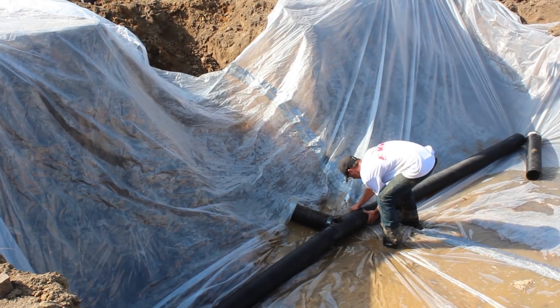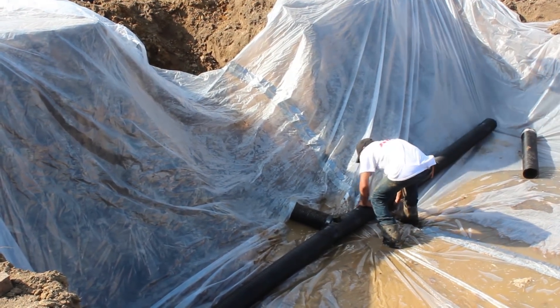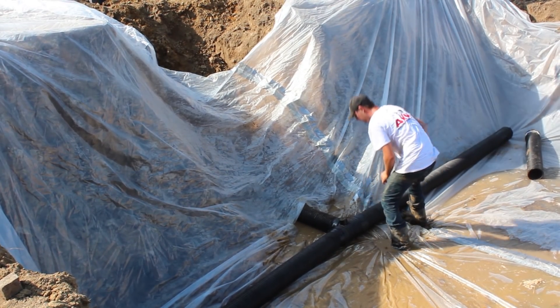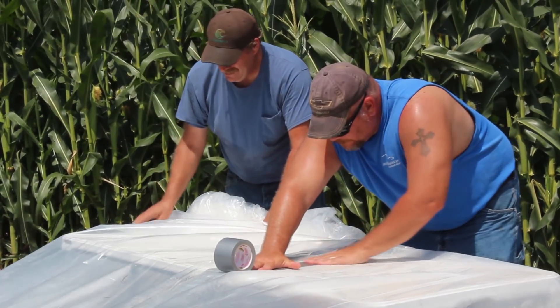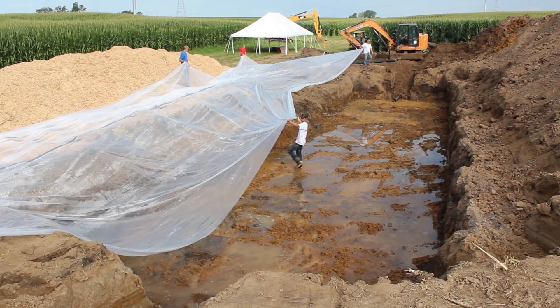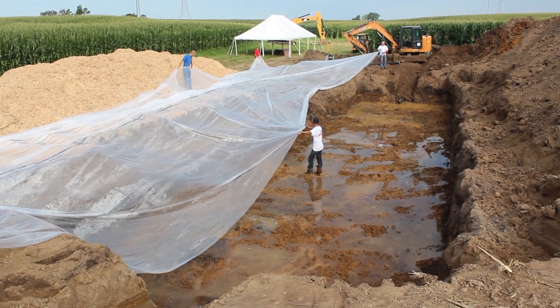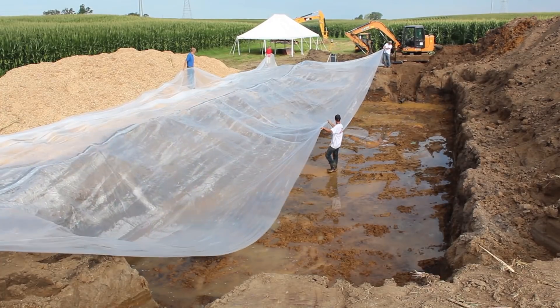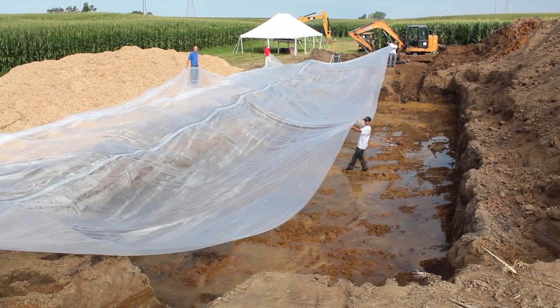This collection manifold allows the treated water to drain out through the second water control structure. Under the manifolds you can see a plastic liner. The liner is installed after the pit is dug but before the pipe is laid, to prevent the soil and wood chips from mixing. The plastic liner also helps to make sure the water stays in the wood chip chamber long enough for the microorganisms to treat the water.